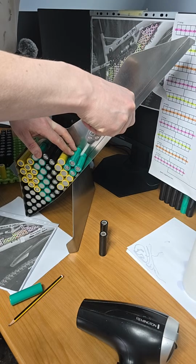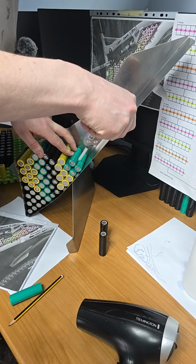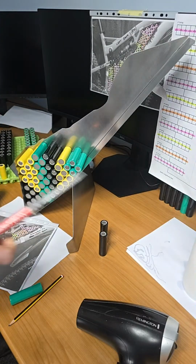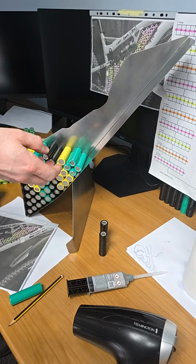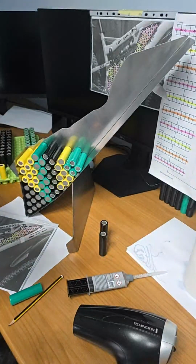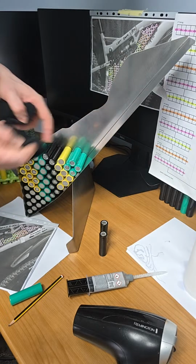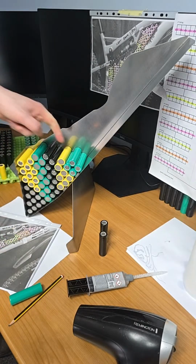Put my finger on the seal. Snapping it off so that when the glue flows, it has a nice smooth finish. It'll run a wee bit out, so that's why it'll come right out to the edge. Okay, we don't want the epoxy running over now. So again, a wee bit of IPA on this rag like yesterday. I'm just going to put my finger on the seal and pull this, and it leaves a perfectly straight bead. Okay, and here it already is perfect.